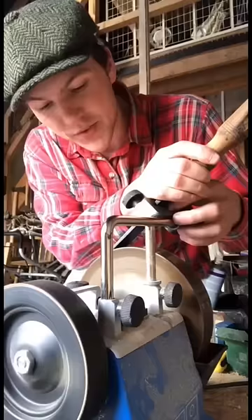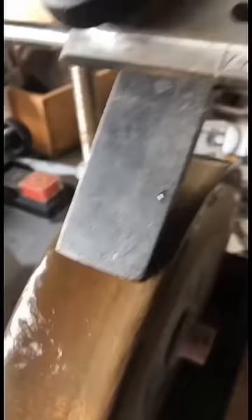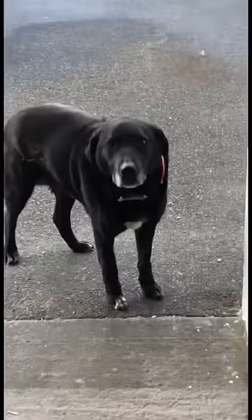It's very important that the chisel is sharpened on a water-cooled grinding stone. This is because if it wasn't cool, the chisel would heat up and lose what's known as its temper. That's where the phrase 'don't lose your temper' comes from, because it'd heat up and go all red, and then it wouldn't be as hard and it wouldn't hold an edge as well. Looking for food I suppose, is it?